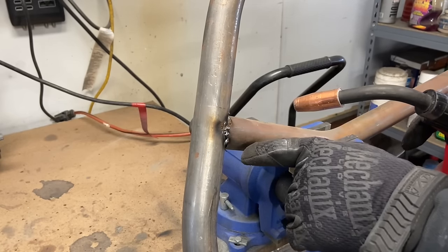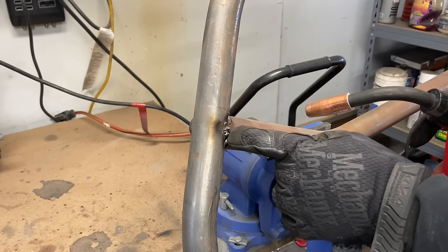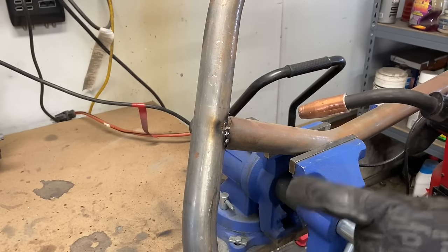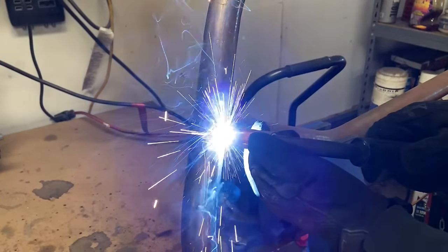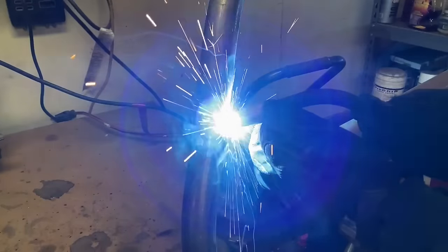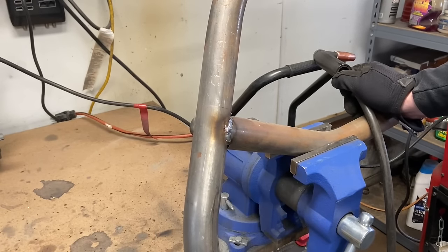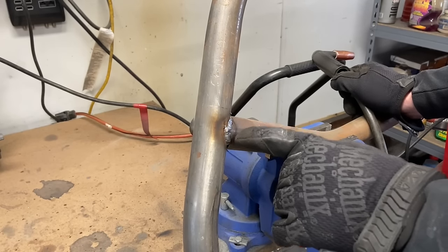The secret of this is the pool. You're going to get a shiny red pool, and you're going to pull from the pool, go back to the pool — pull from the pool, go back to the pool. You want a nice red hot penetrating heat to get both pieces together. I'm not teaching you how to weld — I'm showing you what I did to learn to have confidence in my welds. I go slow to make sure I get penetration; professional welders can go fast so there's not a lot of weld in the joint. My welds are big but they're strong.